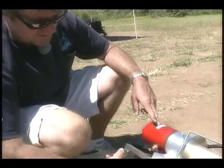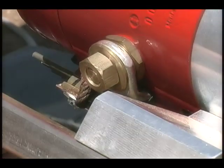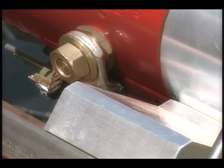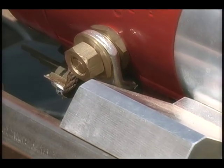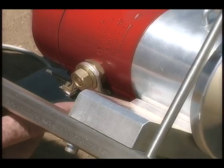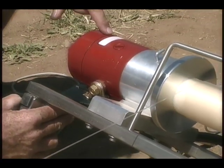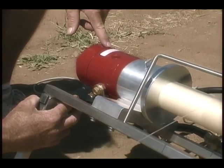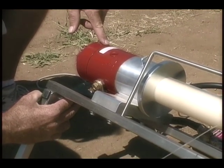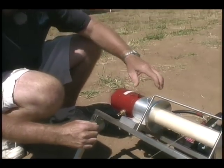The motor is fixed with resistors. Resistors are mounted underneath the winch with a sliding contact bar that you can slide in for less resistance and out for more resistance. For further increased resistance, you can remove a bar or two. Sometimes the batteries are extremely efficient and we have to take a bar out to make up for that increased efficiency so we don't exceed the power the winch can output.